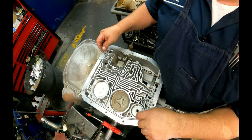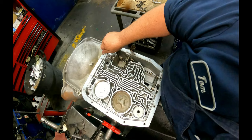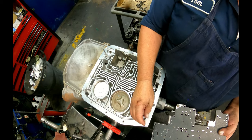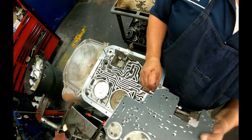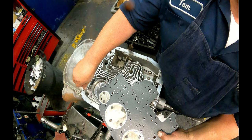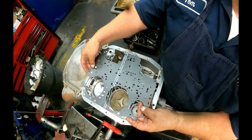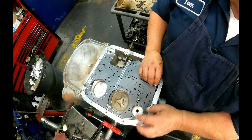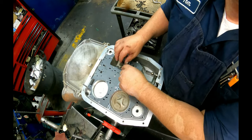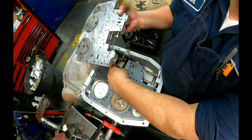All right. And put a couple of lineup pins. I'm trying to remember exactly where they are. It's actually this one. This one and this one over here. All right. It helps to do this because it's easier to screw your gasket up. I'm trying to line all this up at one time. You gotta line your linkage up, you gotta line your throttle linkage up. Linkage has to go there, your throttle linkage has to go in between here.